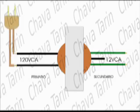If we connect an AC plug to the wires going to the primary winding, a voltage that depends on the transformer step-down ratio will appear at the output of the transformer, that is, on the secondary winding green wires. In our case, we need to get ourselves a 12-volt filament transformer with a current carrying capacity of about 2 amps. To use our voltage reducer, we must connect the filament transformer as shown in this drawing.